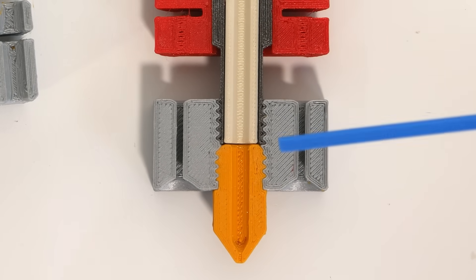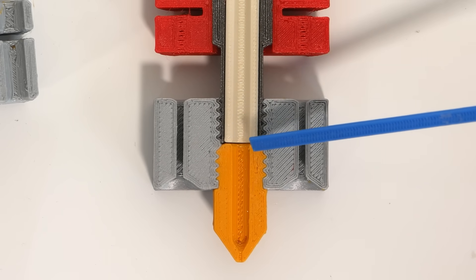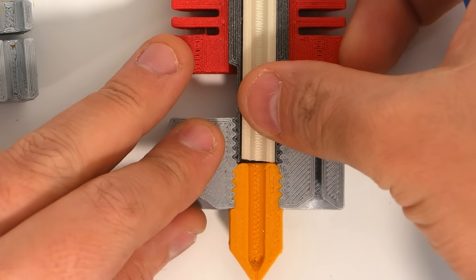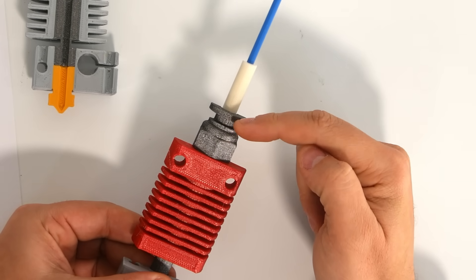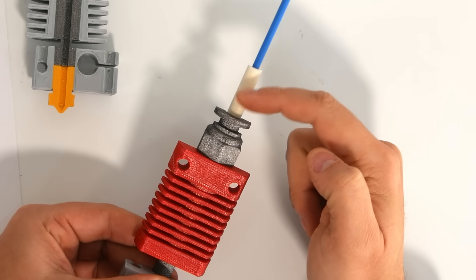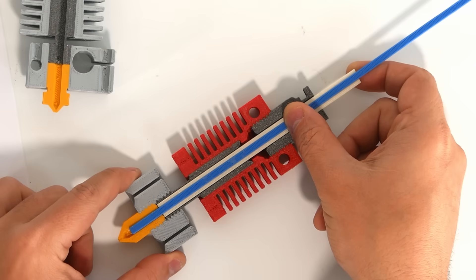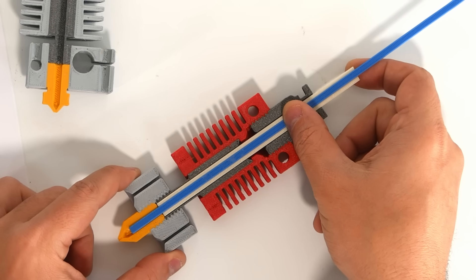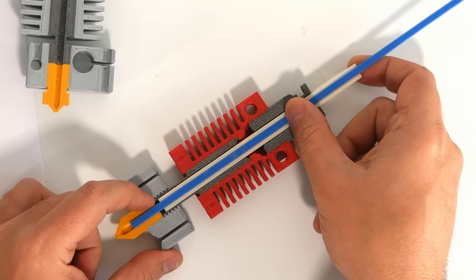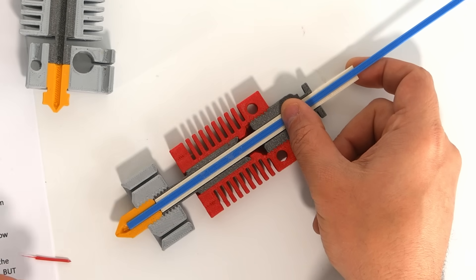Now with the MK10 hotend, most jams tend to occur between the nozzle and the PTFE tube. If the PTFE tube is not sitting perfectly flush with the nozzle, filament tends to start accumulating and restricting the flow. There are also cases where the PTFE coupler — which holds the PTFE tube in place — starts slowly failing, which is a common occurrence with cheaper ones. As retractions happen during the print, the PTFE starts slowly generating slack around the coupler and gets pushed in and out, creating a gap between the nozzle and the edge of the PTFE, resulting in the same accumulation of filament which restricts the flow.